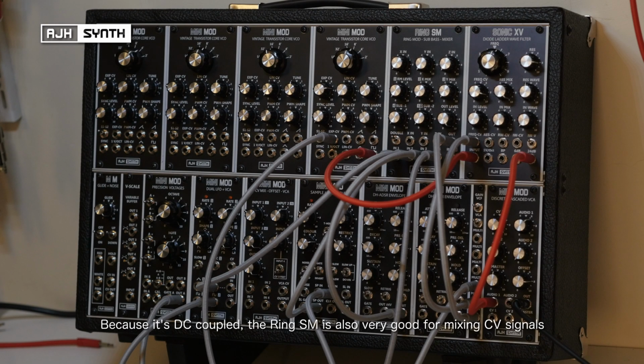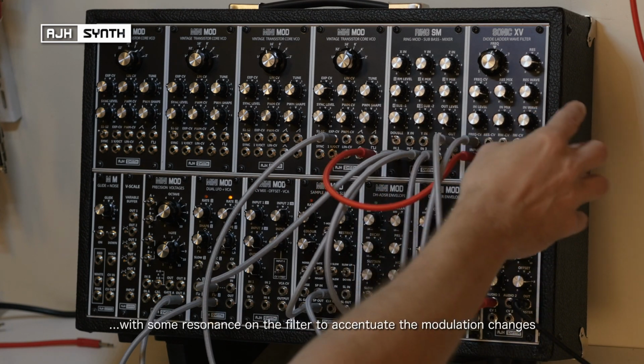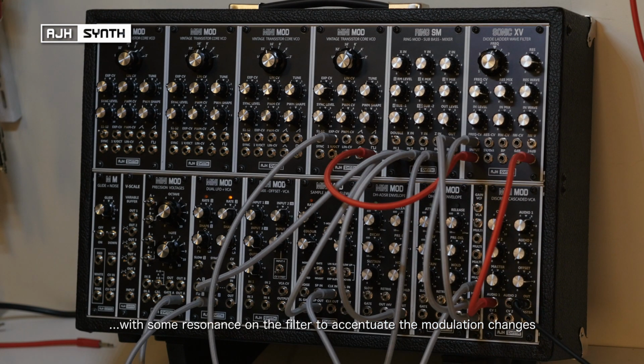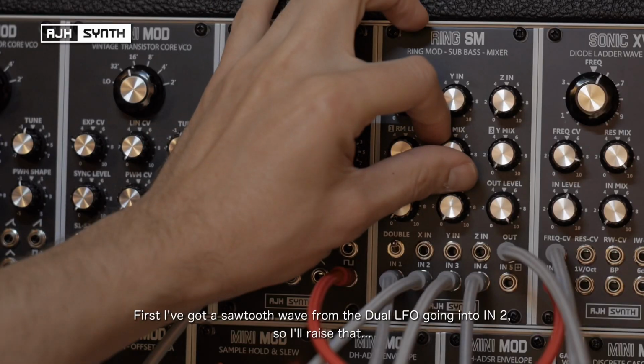Because it's DC coupled, the mixer on the Ring SM is also very good for mixing CVs. At the moment I've got a bunch of different things connected into this just to illustrate how you can combine them, and they're both modulating the pitch of a VCO and the frequency of the filter over here simultaneously. And I've got a bit of resonance on there just so that it's a bit more audible. So first of all, I've got a sawtooth wave from the dual LFO over here going into input 2. So if I raise that,